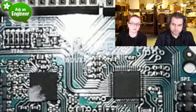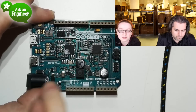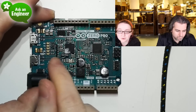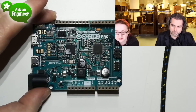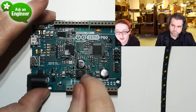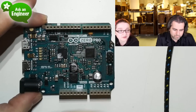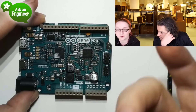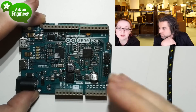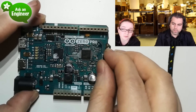It's very similar in size to an Arduino Uno — looks pretty much the same — except there's this extra port and a switching converter which is nice. This is all 3.3V logic, so be aware: if you need 5V logic to drive NeoPixels, you might have to use a buffer like the Teensy LC has. It's interesting that Arduino is finally heading in the direction of Cortex M0; there have been STM32 M3 and M0 versions for almost six years, but now there'll be an officially supported version in Arduino 1.6. We only have a couple — we might be giving one away later.